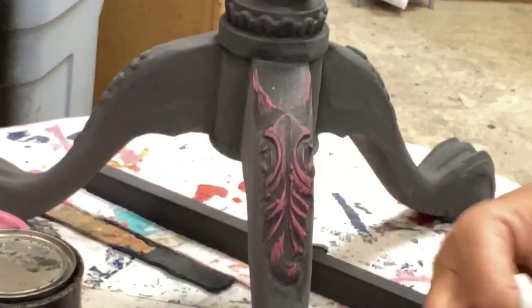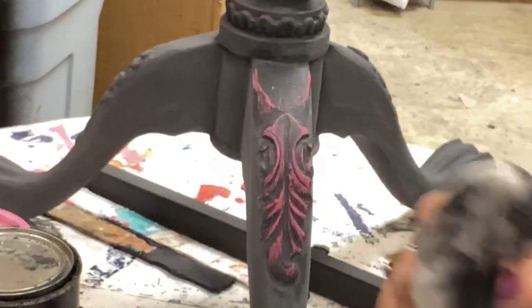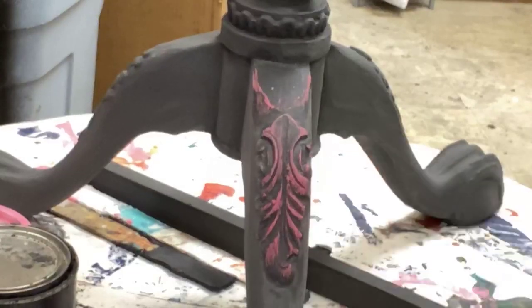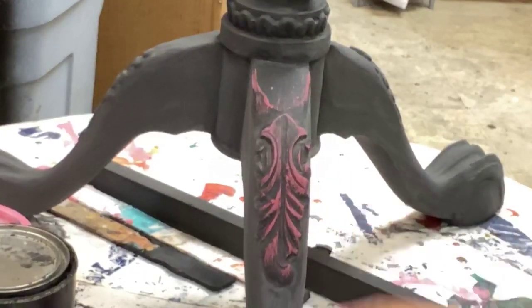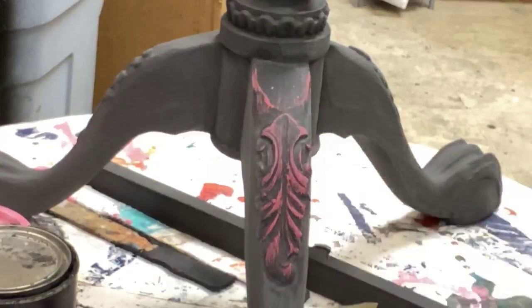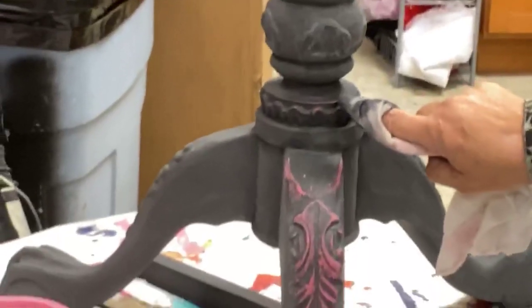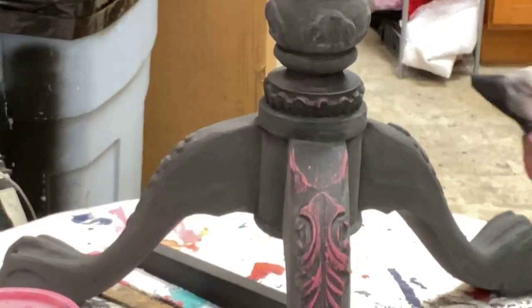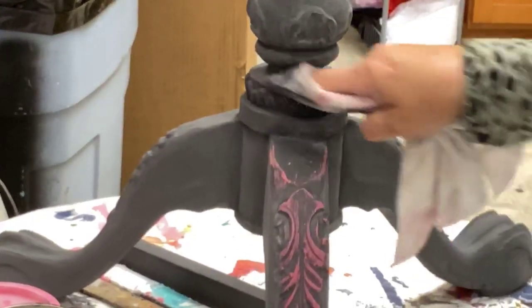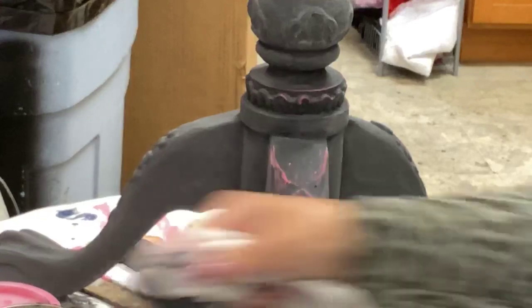When you're doing a piece of furniture, a lot of old distressed furniture has sort of little scratch-outs here, and a little scratch-out there, and a little scratch-out there — all about the size of a quarter. And they don't look that good, because that's not how things distress. Things have natural rub places. Look at the furniture you have where you go, that really needs to be touched up. There are places that are going to be natural for rubbing along edges. That's a natural rub space. It's not going to be natural if I get a rub space up in here, unless somebody has a tendency to stick their feet in that spot. So you have to pay attention to what would be a natural, organic place for the distressing.